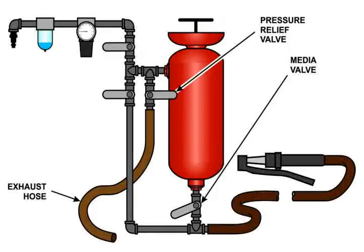The pressure relief valve is an addition you should make to facilitate depressurizing your pot when you are through using it or when you need to load more abrasive into it. Many pots come with a small brass pop-off valve that usually has a wire ring on it that can be pulled to open the valve. This is a safety feature designed to protect you from injury in case of over-pressure and should not be used to depressurize your pot. Using it for this purpose can damage it because media comes out with the air and can stick in the valve, causing it to no longer function as designed.